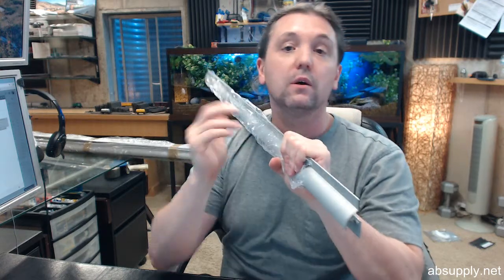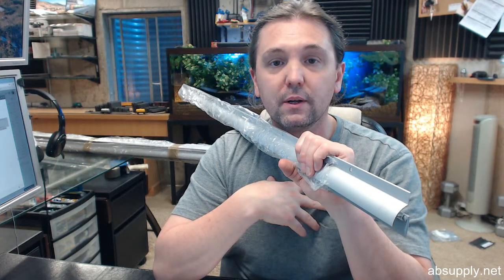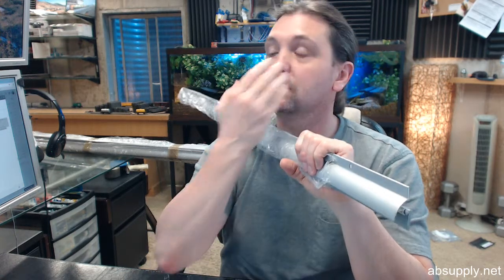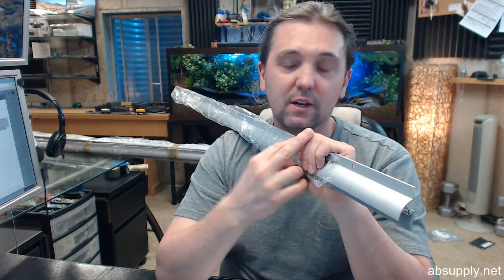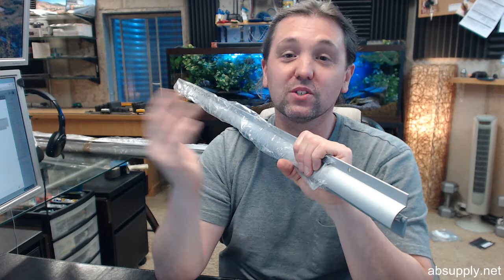If you are a fella or a lady who installs doors and frames for a living, you might want to think about incorporating drip caps at the header and at the bottom as your standard package. Those contractors who did that will never again do it without a drip cap. I have witnessed mysterious instances of water getting in, cases that can't be cracked, but as soon as that drip cap was put on, problem solved, and it's still mysterious to this day. It kicks the water out a little bit, just far enough to keep it off that front line defense of the vinyl.